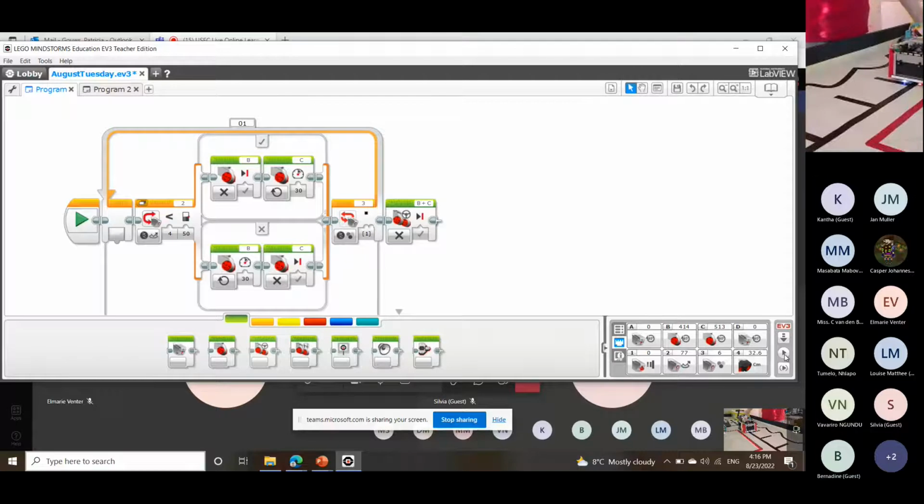And then we had, so that's what I showed you. I showed you if you have two color sensors, how you use the one to follow the line and the other one to stop at an intersection. And then I showed you the distance sensor with the ultrasonic, and I showed you how to use a touch sensor. I would really encourage you to spend a whole lesson with your learners on each of the sensors, just to make sure that they actually understand what they're doing.